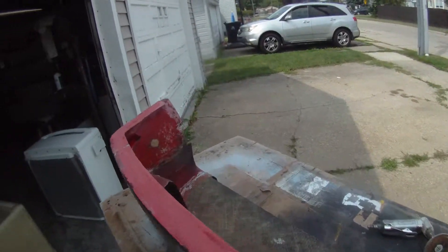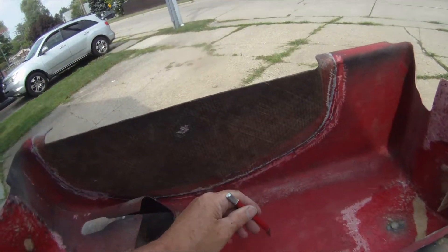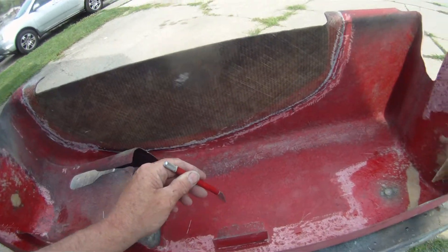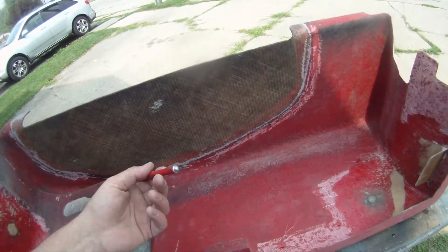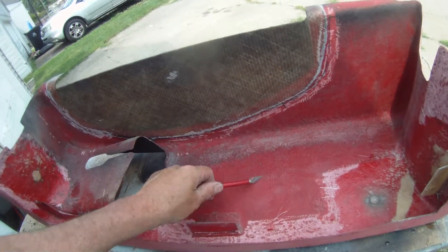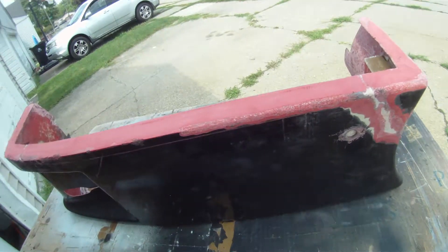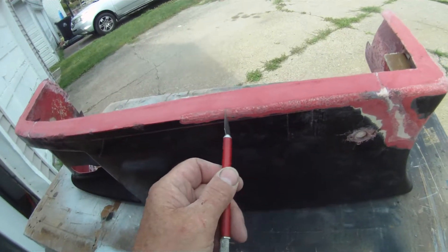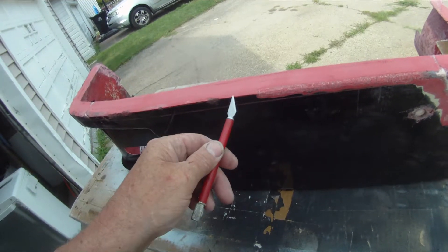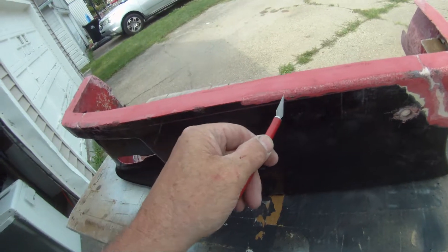I don't know what the Brits are doing. The glass here — it looks like they either pigment the resin or they're mixing gel right into their resin or something. When you grind it, the glass should be white or clear, transparent. As you're grinding down, this is raw glass here. We're past the gel that made up the corner from the inside of that sharp corner of the mold, but it's still red.